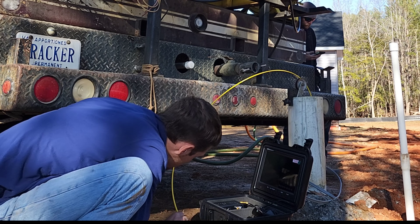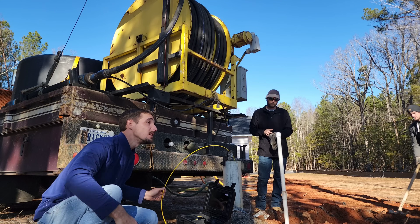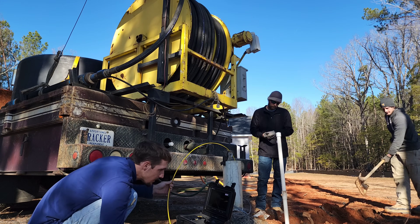There's the water right there. Static level? 13 meters — so 13 times 3 — that's about 40-foot static level. So right there is where the casing meets. That's where the casing and the metal transition — the PVC, the transition coupling, you can see the glue and then you can see the metal. We're going to have 7 feet of metal here, and then we will see our transition to the rock really soon. Got some rock drill oil stuck to it.